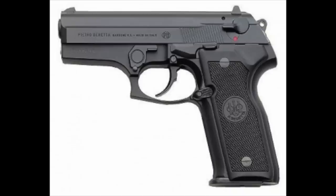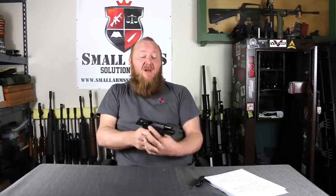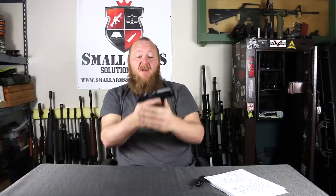Skipping forward to 1999, a new pistol appeared from Beretta called the Beretta Cougar. It was designed to be a smaller, more compact alternative to the 92/96 series pistol utilizing a rotating barrel mechanism. One of the really nice benefits of that system is because the barrel is rotating and coming straight back — rather than dropping down — you get more of a push than a snap on recoil, much like the 92 series, making the recoil of this type of pistol very pleasant.